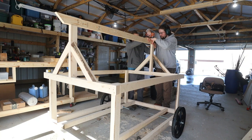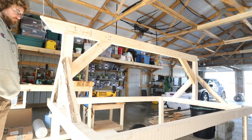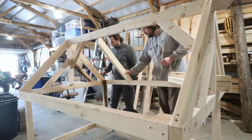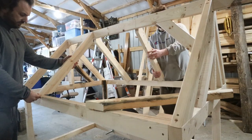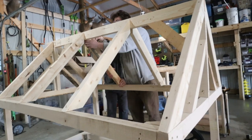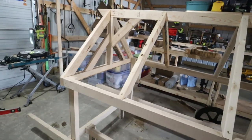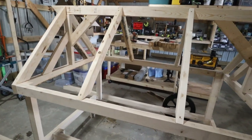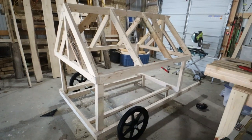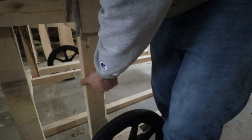This is what I mean when I say it's built for northern winters — the pitched roof gives the chickens more space inside, and this is where we'll put the roosts. Most chicken coop designs I've seen don't have a roof like this. The pros are it gives them more space and snow should shed off it, making it easier to handle in winter. The cons are the roof isn't on hinges so you can't open it from the top, and it takes more lumber and time to build. But for what we're looking for, the pitched roof made more sense.